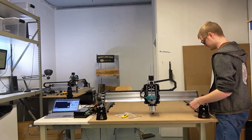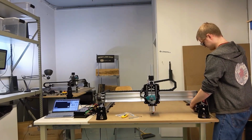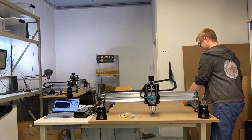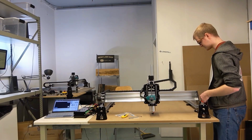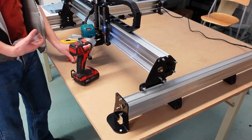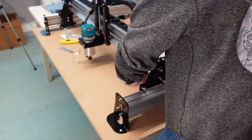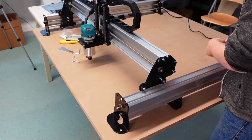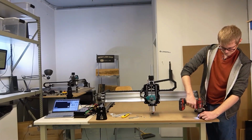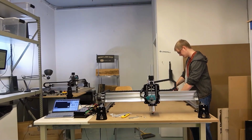I'm also going to be putting in now the back screws for the middle feet, and then after this is done, I'm going to be putting in the remaining screws for the right side. And just remember for the plastic feet that you don't reef down as hard on these as you do on the metal feet. The metal feet can take whatever you throw at them, but the plastic feet, if you are really giving it, you could potentially break them, because obviously the screw is going to hold into the MDF much stronger than the integrity of the plastic will. And I'm just going to put down the other set of screws on the other outside feet. Make sure you don't strip out your MDF surface or whatever you're screwing to.